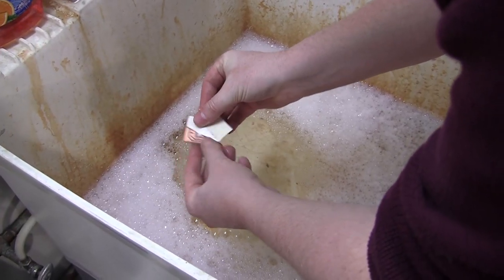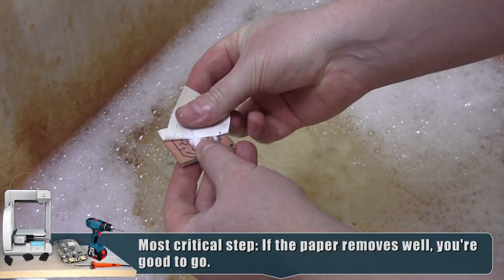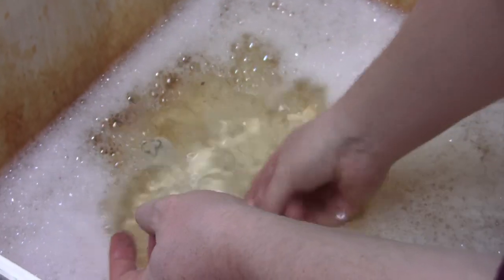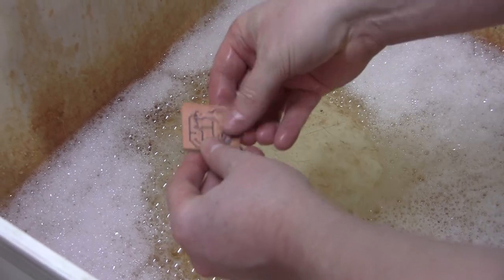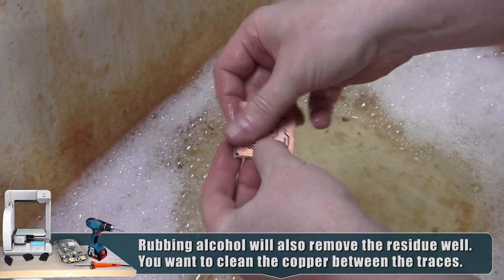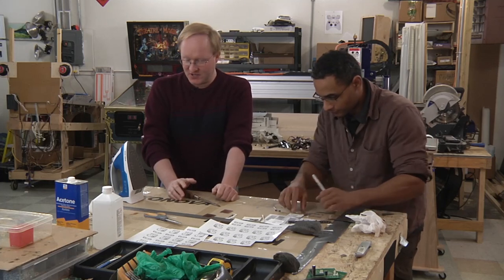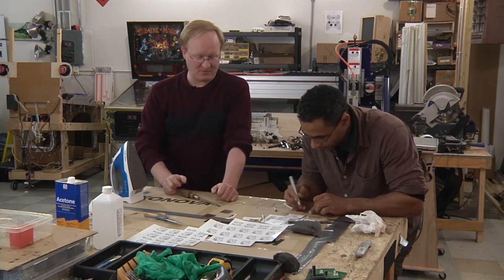I'm going to pull this off at a low angle, not straight up, so we don't lift off the traces. If you pull it flat they have a very good chance of staying on. There are little bits of residue so I'm just going to get in with my thumb — could also try one of these scrub brushes. The trick seems to be a good combination of heating up for a long time, maintaining good pressure with your iron, and letting it soak in water for a good 10 minutes. Patience is a virtue.